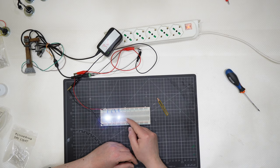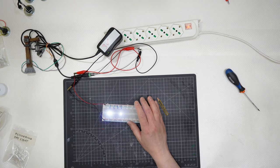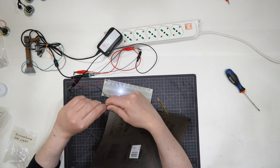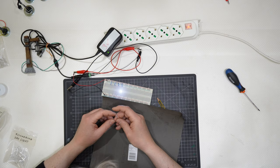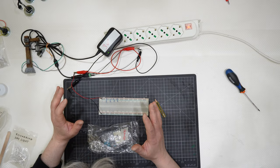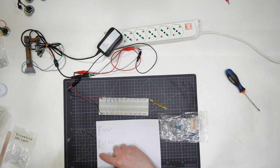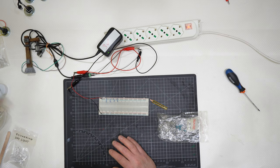If you don't find them on the market and you want to use those foggy, less powerful but more diffuse lights, you can simply use some sandpaper on the very clear plastic, working on the bulb itself. You can sand it and the plastic will no longer be perfectly crystal clear, but opaque, and so the light will diffuse more. You have just seen me using some white ones, and they work as I told you in the last part. White, blue and green work at 3 volts, yellow and orange at 2 volts, red between 1.8 and 2 volts. So everything I've shown you works at 3 volts.